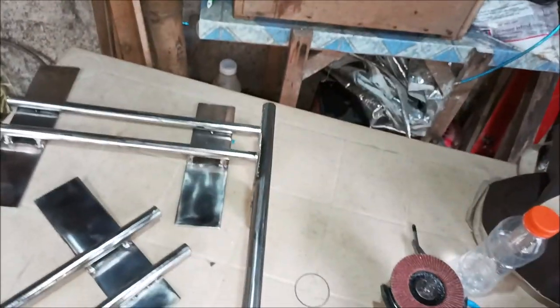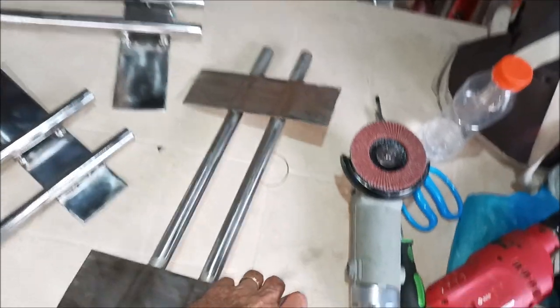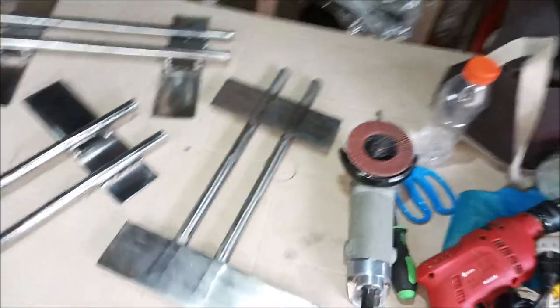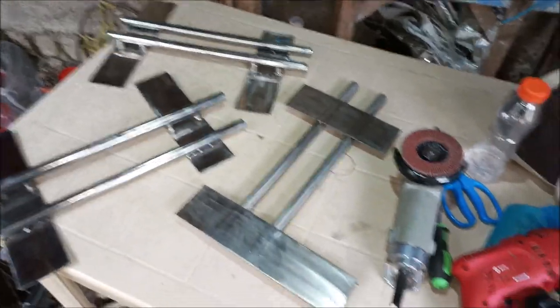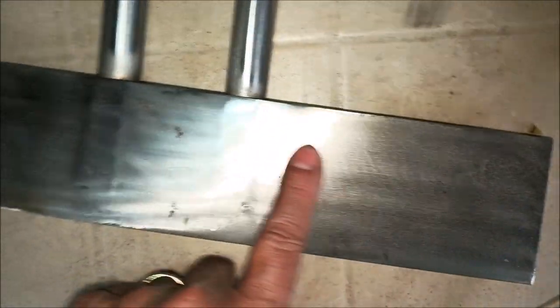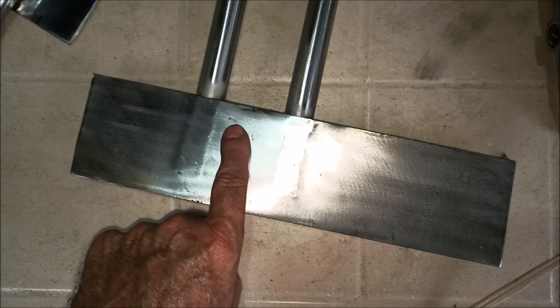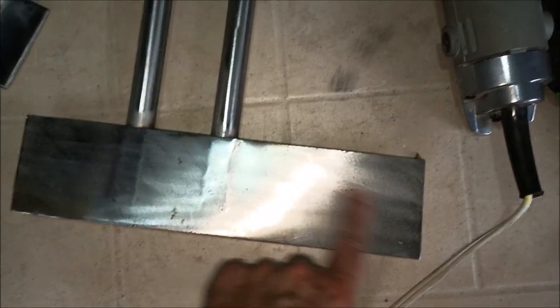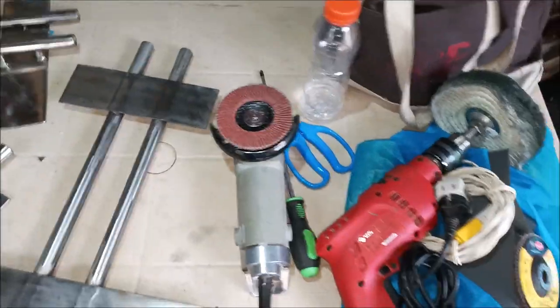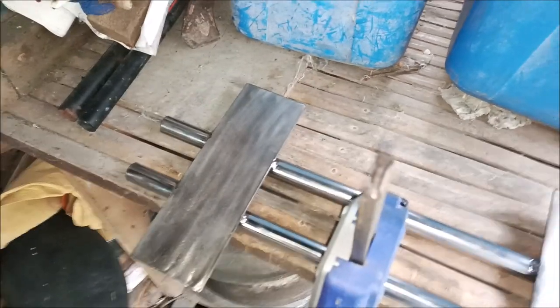Right now they're tweaked so they slide just like a trombone — smoothly. This side going against the boat is semi-polished from the welding shop. The epoxy doesn't stick well to slick surfaces, so I'm going to put a 40 grit grinder on the backs of these and put some texture on there to help the epoxy cling. We're also going to have screws. That's the whole plan.